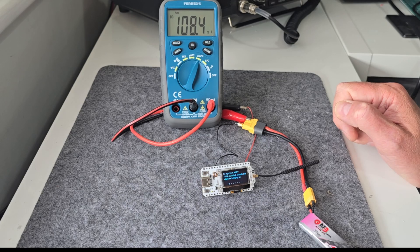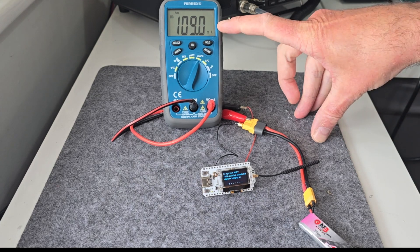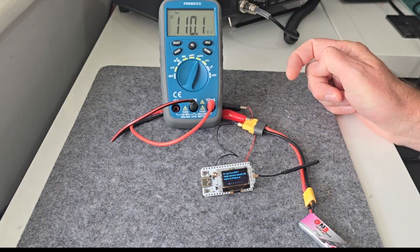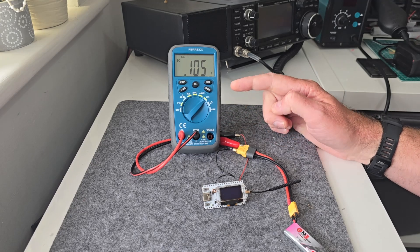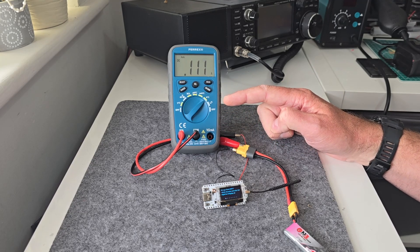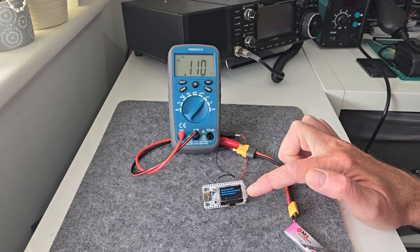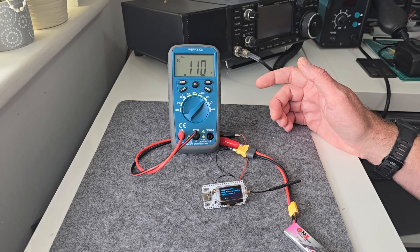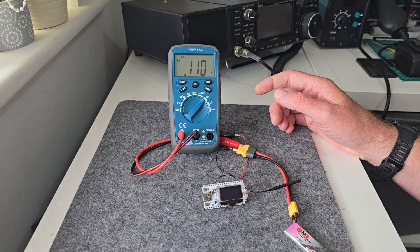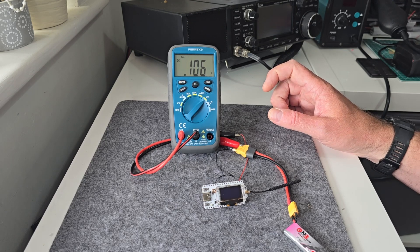Obviously you've got the OLED screen on there as well. We'll wait for it to settle. When it transmits you'd add another 180mA and get an overload. I had to swap the multimeter inputs because it was too much for the 250mA range when transmitting. It's also in client mute now so it's not transmitting as much. The OLED screen is on — set to 30 seconds timeout — and you can see we're above 100 milliamps. The OLED just turned off and it went down a few milliamps, but you're not getting the other side of 100 easily.